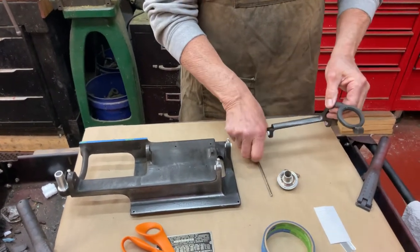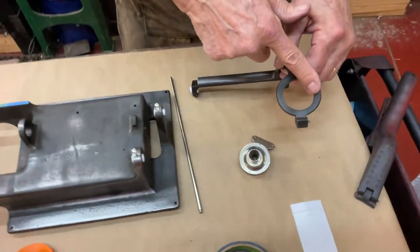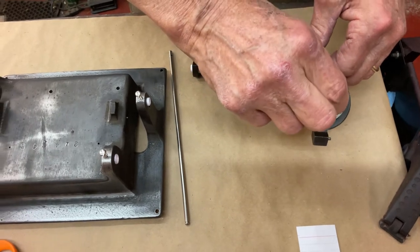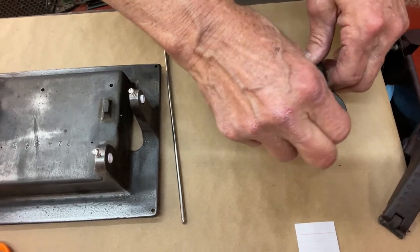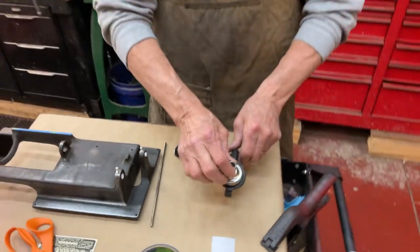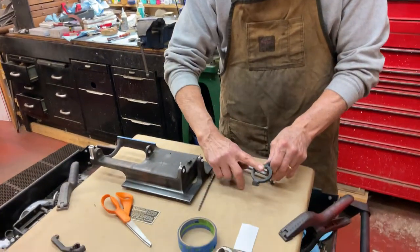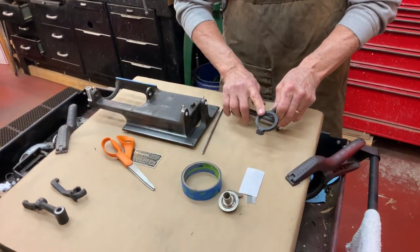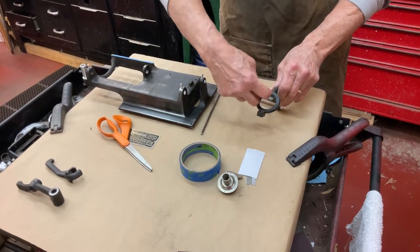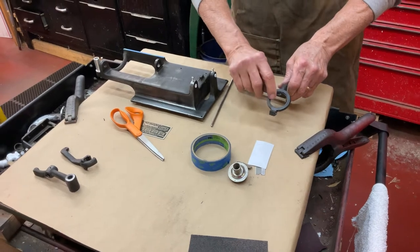Also, critical — you have to blue tape all this in where the reproducer sits, just like that. Because if this is full of paint, you can't get the reproducer in, and I have to go back and do that. What I do is tape like this, just take little pieces of tape, and work it into the recess area of the carriage, and mold everything in.